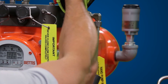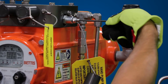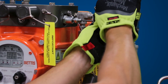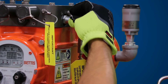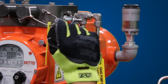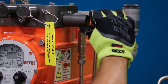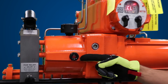Open the hand pump isolation valve counterclockwise to return to automatic operation. Ensure the lock nut is tight to make sure the isolation valve is locked in place. Check the reservoir to see that the hydraulic fluid is at the proper level.